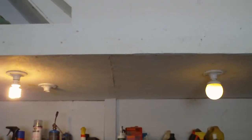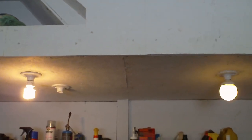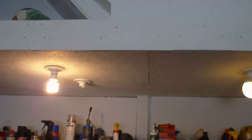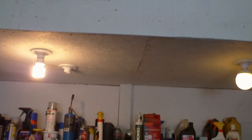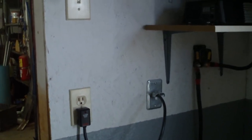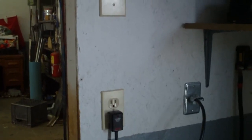This switch runs these lights. The idea is I don't have to turn on all the lights in the garage when I want to work in the shop if I'm just working at the bench here, because it's almost a kilowatt to light this garage — that's my next project. I'm powering those off of it, and I'm also running all of the lighting upstairs in my garage off of that cord. My yard lights also run off of that cord. If there's something wrong with the system, I can just take that plug, plug it back into the grid, and now everything is on the grid.